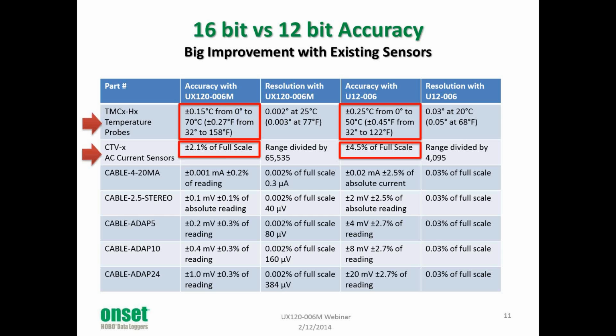And for the most part, I'd say yes. Typically you're looking at the cable length itself. So in terms of the temperature sensors, you'd want to pick something that's appropriate, 1, 6, 20, or 50 feet. If you need to go longer, you can get extension cables from a product like from Radio Shack. But if you run these too far, you want to make sure that it's twisted shielded cable, so you're not picking up any additional noise.